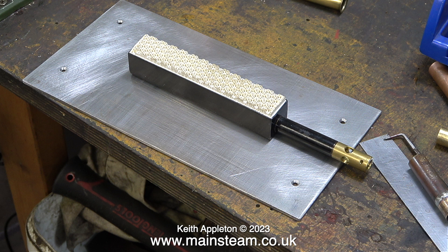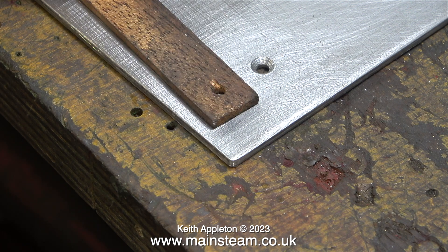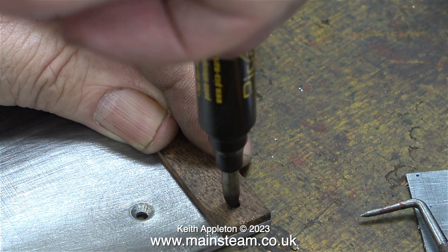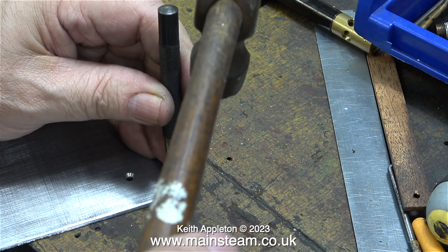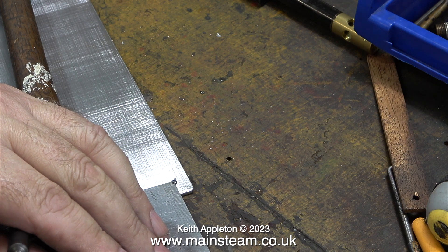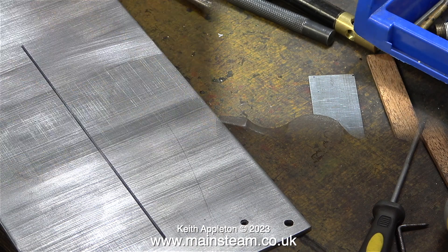Top tip number two in this episode: I need to drill four holes, one in each corner of the metal plate. I've drilled a hole right in the middle of this mahogany plank - all I have to do is line up the plank with each corner, perfectly aligned with the steel plate. Through the hole in the mahogany I'm using a deep hole marker to make a mark on the steel, followed by using the center punch to make a pop mark in the center. As before, the process starts with one light tap. I'm using a steel rule to verify that the hole is equidistant from both sides of the steel plate on every corner - this is a simple job but it can go spectacularly wrong if you hit the center punch in the wrong place.